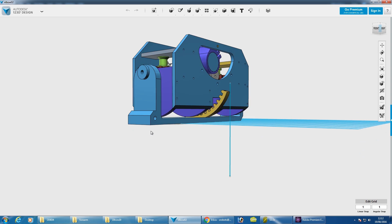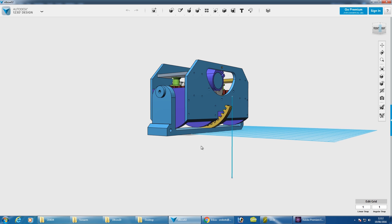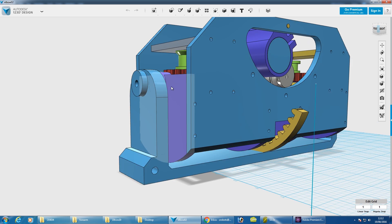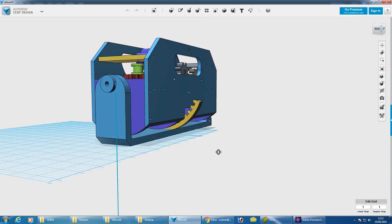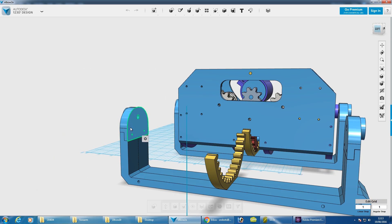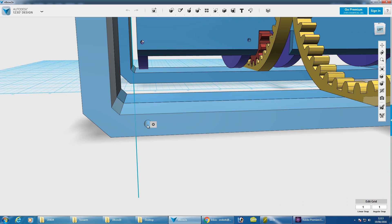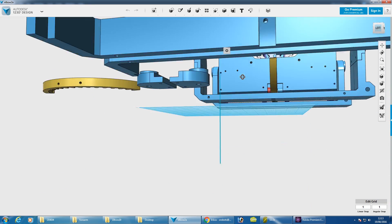Here's the whole cradle assembly. The elbow hinge is going to be down here, and the forearm will rotate around the elbow joint. I've got these hubs at the ends which correspond with holes I already left, and the track is the right radius so the gear always runs uniformly on it. I split that part into multiple parts so they can be printed flat on the bed with the circles the right way around, the back surface flat down. I've split the cradle into two with alignment holes so I can put some steel in to get them aligned, and screw holes in the bottom to key the track in the right place.